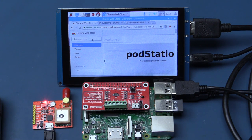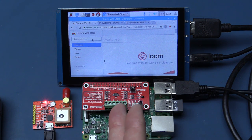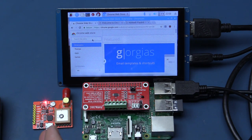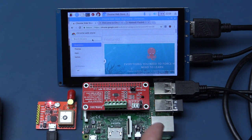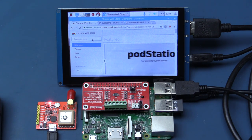Let's get to the PC and look at setting up Node-RED to talk to the I2C bus and to the GPS module. But first we need to do a couple of tests to make sure we can see them. Theoretically, based on the jumpers, the I2C ADC module should be on address 0x48, and the GPS should already be streaming serial data about once per second out to whatever COM port has been set up — probably USB0.